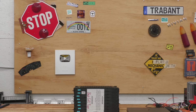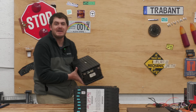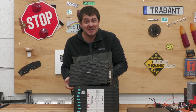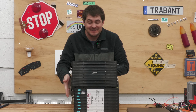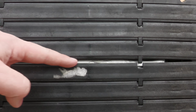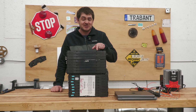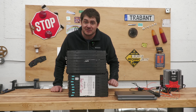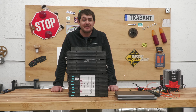However, this battery module has been living in a metal trash can in my driveway known as battery jail. Do you see why? One of the pouch cells in this module got all puffy and is even torn open right here. I've never charged or discharged this module at all. And if that pouch cell in there tore open doing absolutely nothing, what's going to happen when I send current through some of the other battery modules?